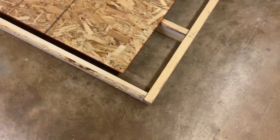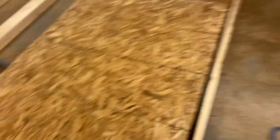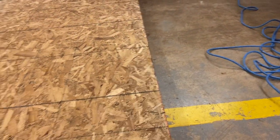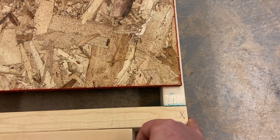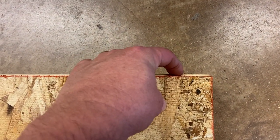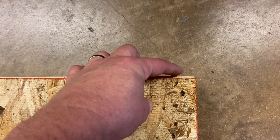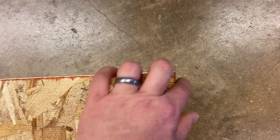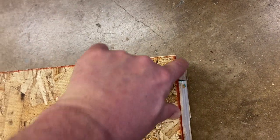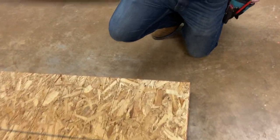So what we're going to do is start down here and get this corner lined up first. Shane, I'll help you up top here, get that corner lined up flush. What Shane's going to do is make sure it's flush with our wall plate right here — not necessarily the stud, but flush with the wall plate. I can just see the roll of this 2x4 right here. There's a little bit of a reveal. I don't want this plywood completely down even with this because I don't want it holding us off the floor. As you can see here, we are nice and flush with the plate. Shane, drive an 8-penny nail into that real quick so it stays right where it's at.